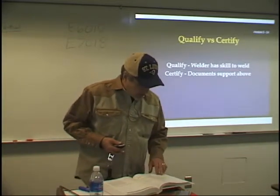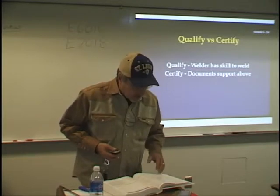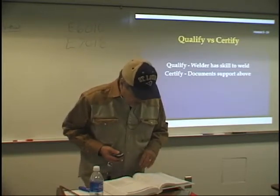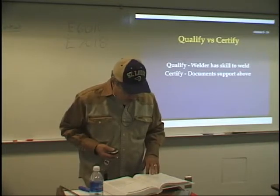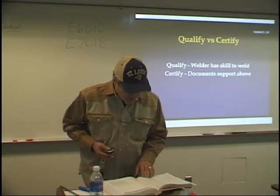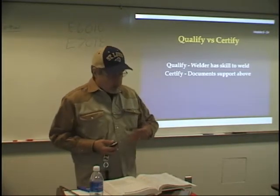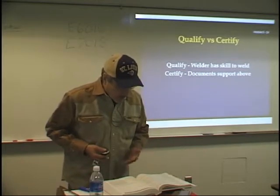Read over the section on the size of electrodes — there's some information there you need to know. Some things that affect it: joint design, material thickness, thickness of weld layers, welding position, amount of current, the skill of the welder. Then go to job requirements. The requirements of the job are the basis for the proper selection of electrodes. Look the job over carefully to determine just what the electrode must do. Study the variable factors given in Table 12-8. You need to know about the skill of the welder, code requirements, properties of the base metal — again the most important thing — and the position of the joint.